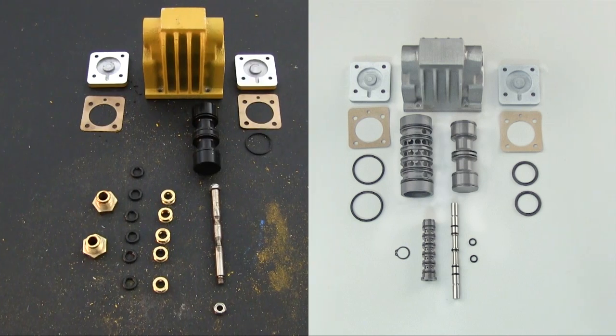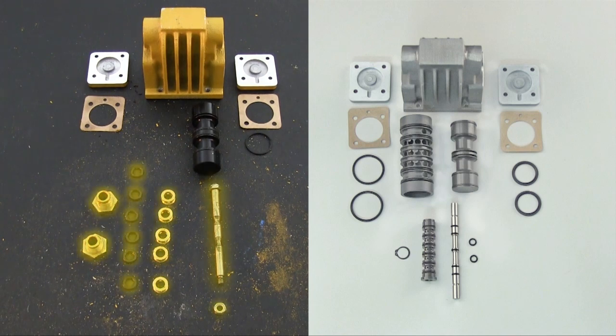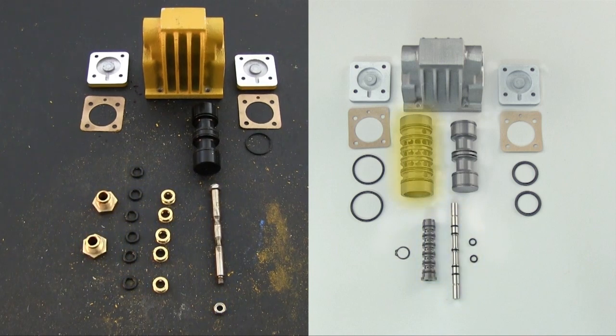In side-by-side views of the assemblies, a few noticeable distinctions become evident. The pilot valve assembly, originally consisting of multiple components, is replaced with a solid sleeve and an upgraded spool incorporating floating pneumatic O-rings and precision control. The air valve assembly features a sleeve that meters the optimum amount of air that the specific pump size requires, improving efficiency and diaphragm life. The enhanced spool introduces two additional glide rings for improved sealing.